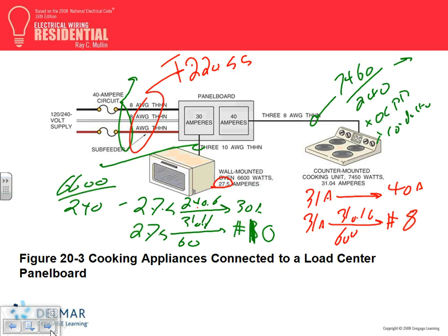Any questions, guys, about the branch circuits? I know you've done a few examples with Gary on the load calculation. They want to make it a load calculation for ranges, but we did the branch circuits for the load for the apartment, and this is just branch circuits, straightforward. Find the amps, find the overcurrent protection device, find the conductor. Yes, assuming it's non-continuous, because it's rare that you're baking continuously, you're absolutely right.